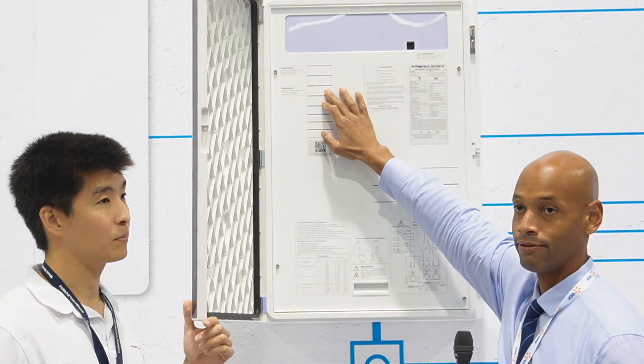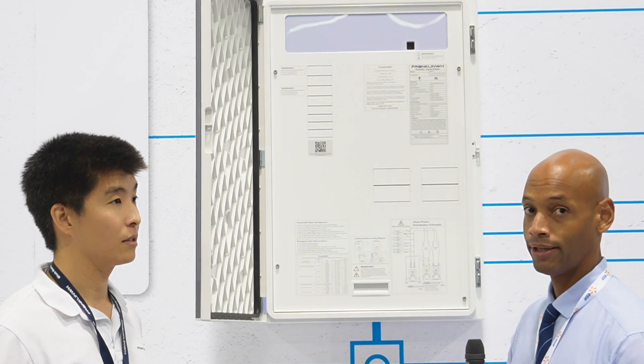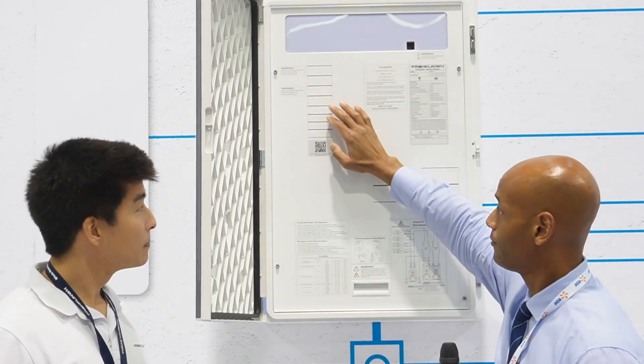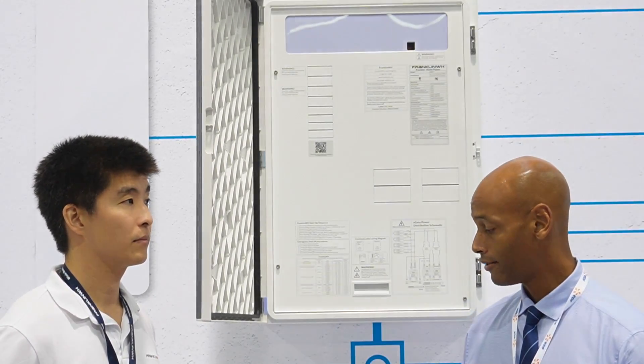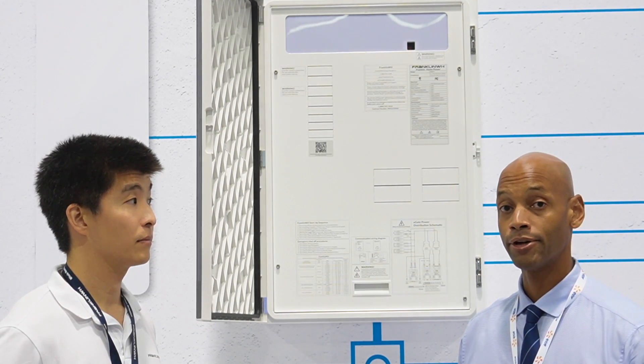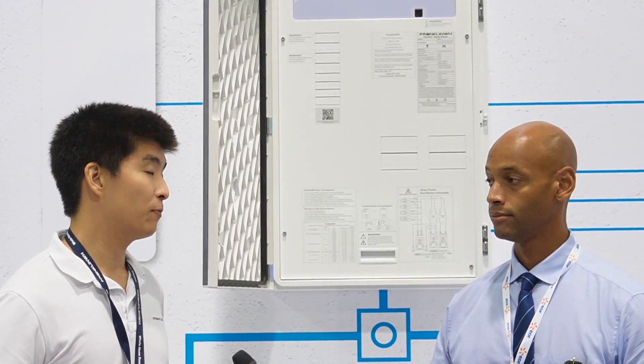Right below that, you have up to 100 amps of AC output from the batteries. You can have several batteries — we're showing two here, but you could conceivably have eight or more batteries parallel connected and delivered on this single breaker. And then finally, you have your two smart loads. Smart loads are loads that you want managed when you're in backup power mode. For example, a home electric vehicle charger — you don't want to drain the home batteries to charge the vehicle battery. It could also be your central air conditioning unit. If your batteries fall below a certain threshold, say 25 or 30 percent, you switch to a low power mode — similar to your smartphone's low power mode — to preserve power to your lights and refrigerator.